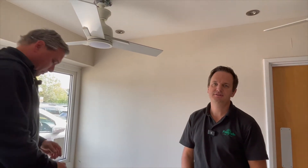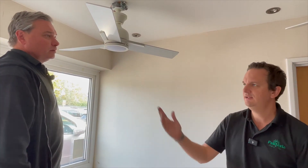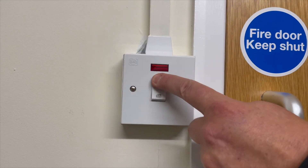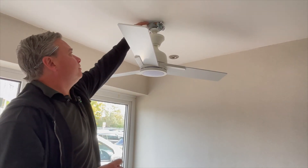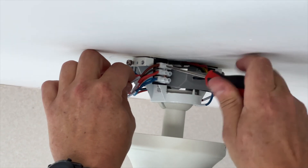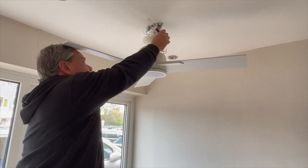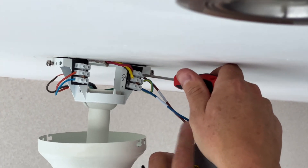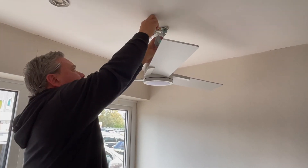This is how to remove the M3 receiver from a ceiling fan, should you need to. Lee is going to demonstrate that. Turn the power off first — very importantly. We're going to remove the wires from the fan side of the remote, which are brown, orange, and blue. That is now free to come out. Then we remove the live and neutral only on the input side of the remote receiver — we leave the earth wire connected.